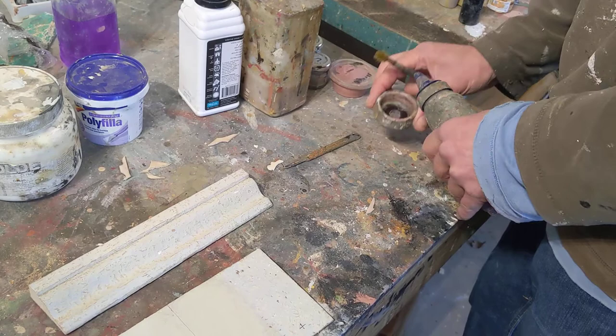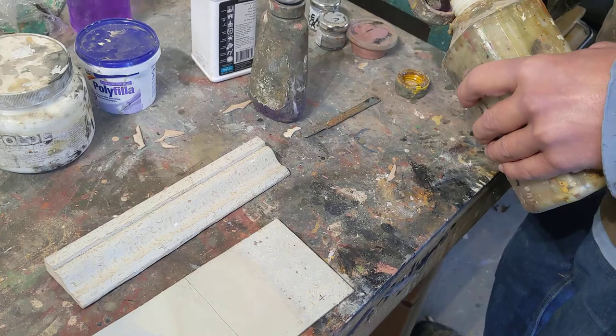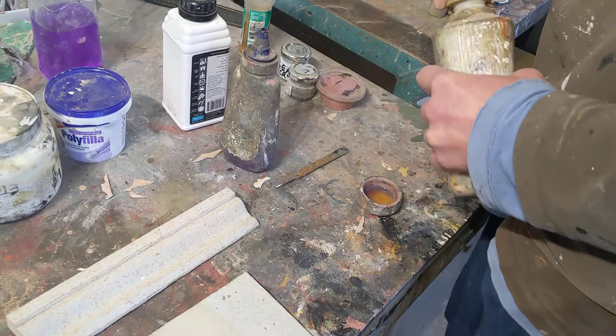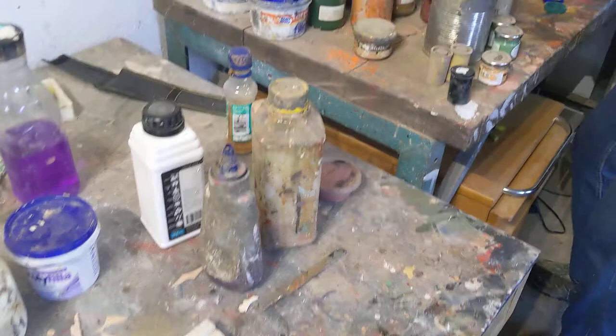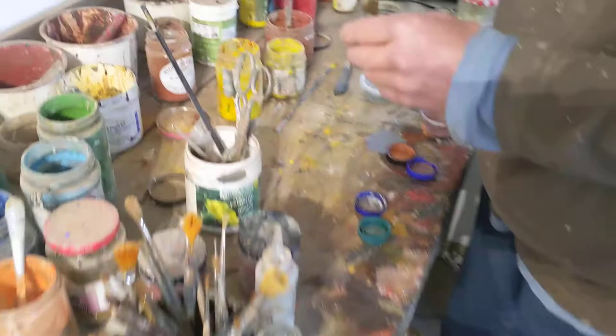You actually don't need a lot of this either because it goes a long way. You probably need a cup full to do two consoles. So I'm doing 50% of each. This is sanding sealer — shellac sanding sealer, not cellulose — because it won't mix anyway. And then I'm mixing raw umber in with it. It could be another colour — it could be raw umber and raw sienna, or a bit of black, or just raw sienna. But I think this works quite well.